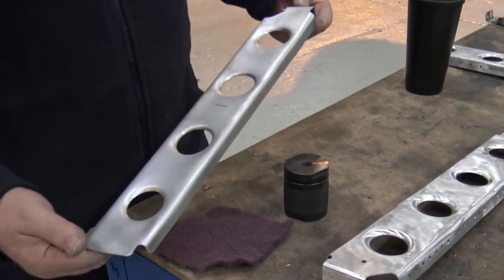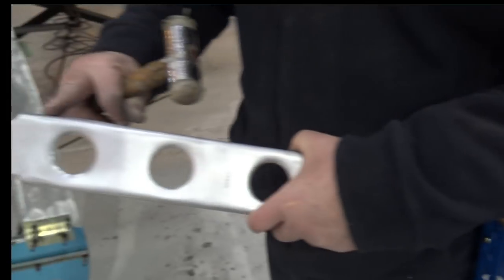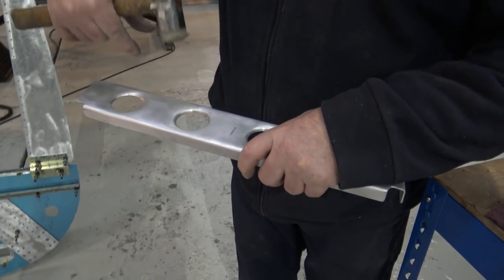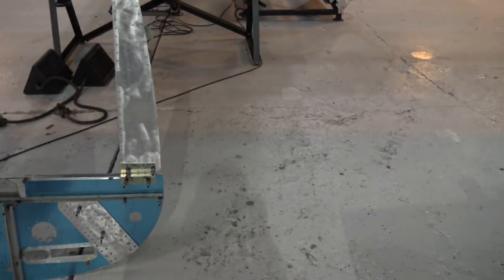Now that looks just the same as the rest. I've just got to go and get a hammer and just knock them down on the vise — see the bulge it's caused. Because it twists as the metal bends round — it twists in, so you've just got to tap it down. Well, good. Thank you, Jack. Yeah, that's great. Pleased to have come out.